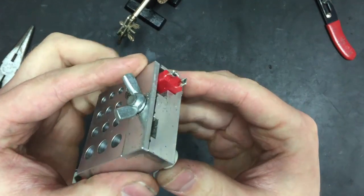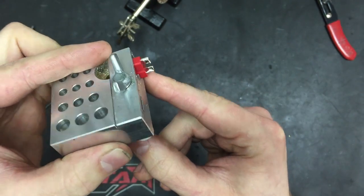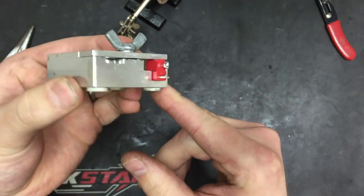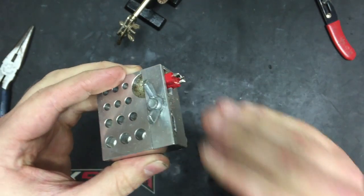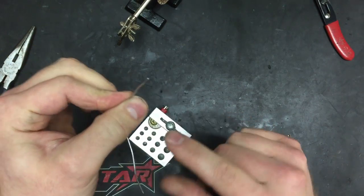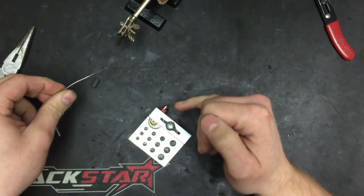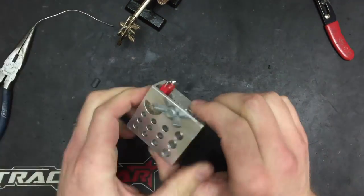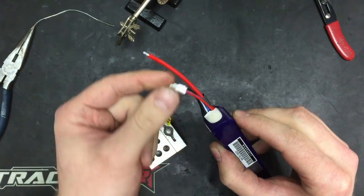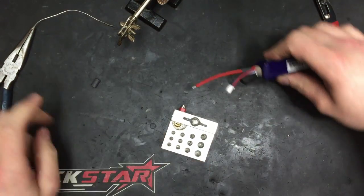You can see there's a nice little dome of solder over the whole contact, and it's all shiny and smooth - that's what you want it to look like. For soldering the Deans connectors themselves, I found that the flux core of the solder is enough to get an excellent join. But it's not quite enough on your thicker multi-strand wire, which is why we use the extra flux on the wire.